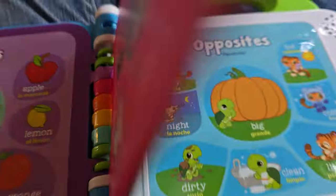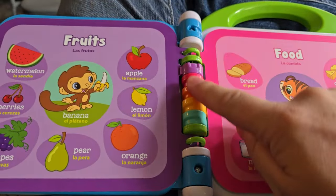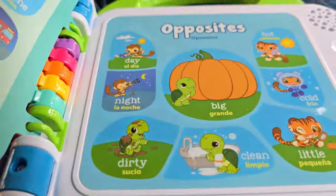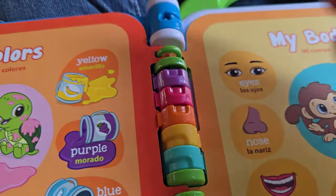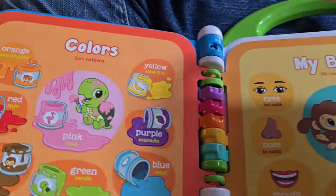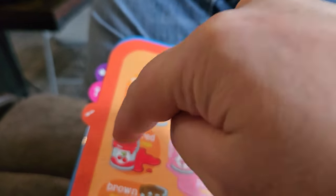It knows if this side is being activated over here, because right here is a page, and you would think that there are buttons. But they're not, and I'm going to prove it - it's not working via press. This is how it determines what page you're on, based on whether this side is being activated through this plastic panel, or all the way in the back on this plastic panel. Notice they're only in certain regions on every single page. What doesn't make sense is how it knows that you're going to touch it, because if it's touch sensitive, the more pages you stack up, the more difficult it is to press through. So it can't be based on that.